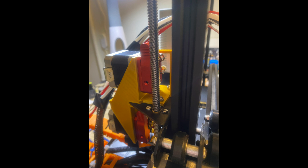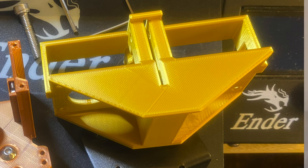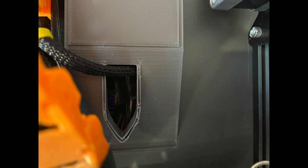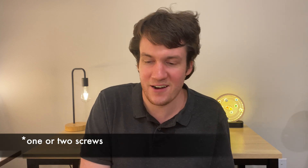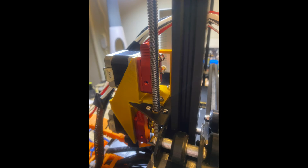At first I tried mounting them both to the X arm where the original extruder was. After several failed prototypes — each of which I thought was going to work, so I'd install everything only to discover it didn't — I was of course losing screws down this massive black hole that conveniently led right to the mainboard. Since I didn't find a lot of the screws until later, there was this constant danger of a screw being somewhere in the mainboard area about to short circuit everything. After all that fight and battle, I discovered the extruders were a little bit too heavy to both have on the X arm.